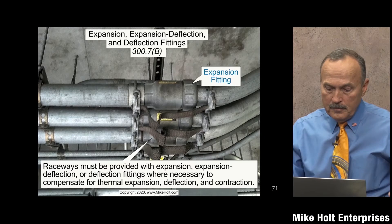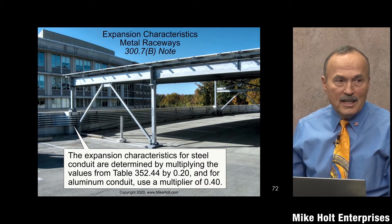This is one of those cases where electricians need to read the instructions. Because depending on your temperature outside, it gives you a gauge of where that fitting needs to be when you install it. We're going to be talking about that when we get into rigid and PVC — we have to read the instructions. Here is some rigid conduit running on the outside.